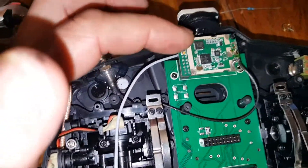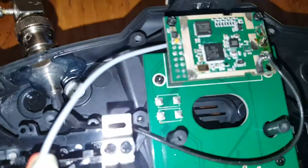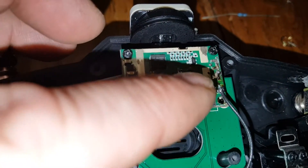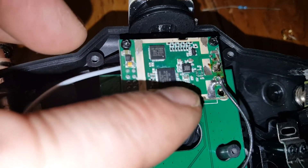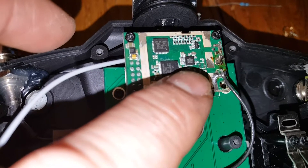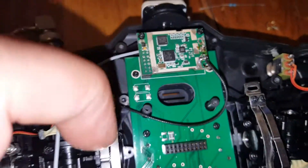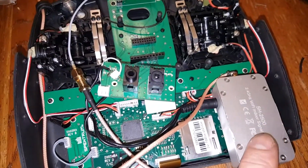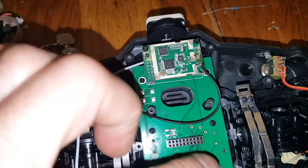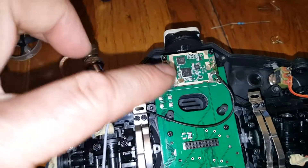This Spektrum transmitter is a MIMO — multiple in, multiple out. On this board there are actually two antennas, and every frame it switches between horizontal and vertical antenna orientation. I did a modification here — probably you're not going to be able to do it, it's a super tiny wire I had to solder under a microscope. I took out the switcher chip and have all the packets going to one antenna, which then feeds around and into the power amplifier. You could do two power amplifiers, or just get a splitter and connect both cables to a splitter and then go to a single output — you don't have to do the extreme board remodification that I did.